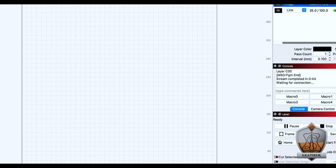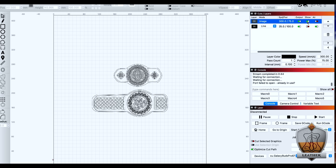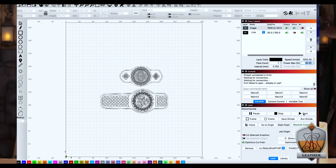The program they sent along with it is called Lightburn, and it was crazy easy to use. All I had to do was tell it which machine I was using, which it saw and recognized right away, and then I just dropped in the engraving file. The last thing I really had to do was dial in the speed and the laser power to actually engrave this thing. I was really winging it — I know one big selling point is that it can engrave at a speed of 25,000 millimeters per minute, which is super fast. But since this was honestly my very first time using a laser, I figured I'd play it safe and set the power a little lower and the speed a little slower. And just like that, I was laser engraving.